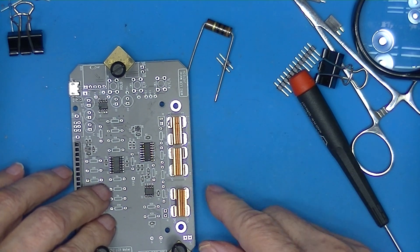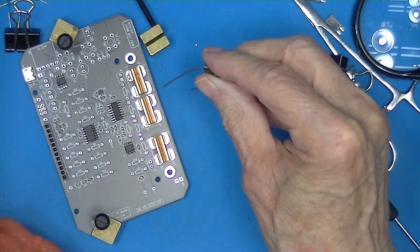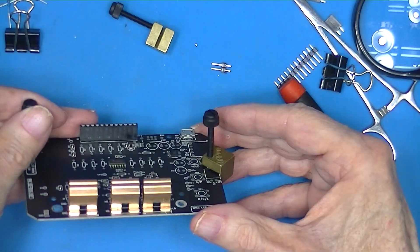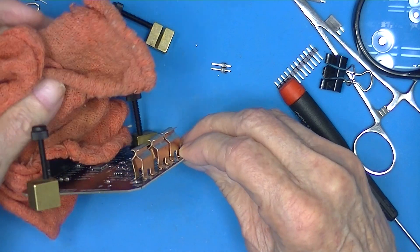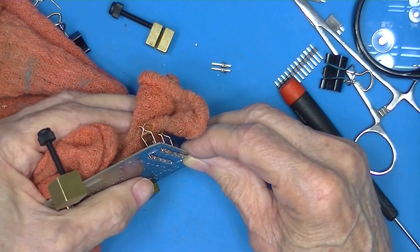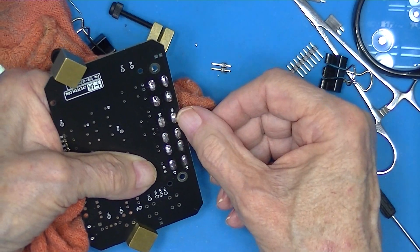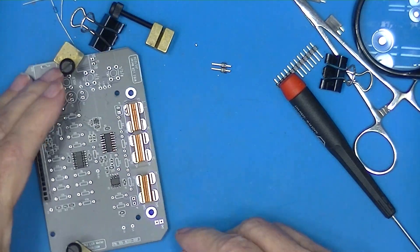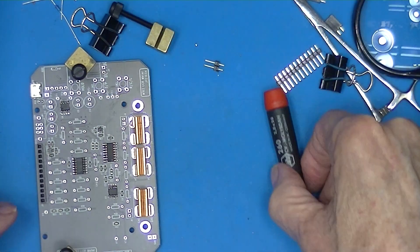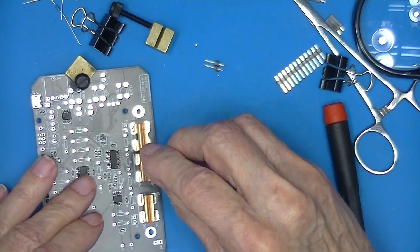This one's out of line, so I'm going to try to move it back. Despite all the jigs and tiny clamps, it looks like the best thing to do is to adjust them after you've soldered them — put some force on them whichever way you need to go, then re-melt two tabs. That way you get them all parallel, inline, parallel with each other, and they have the ability to spring open to accept the component.